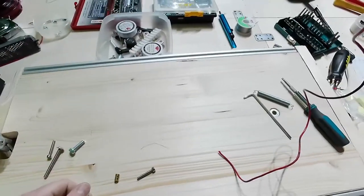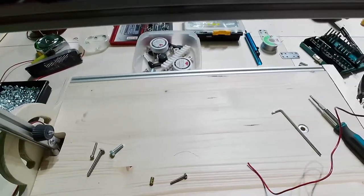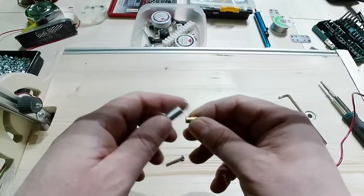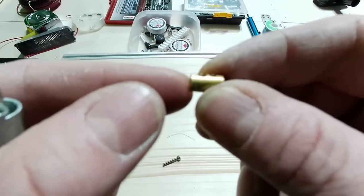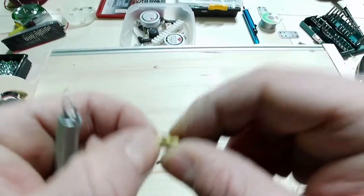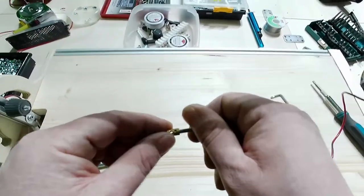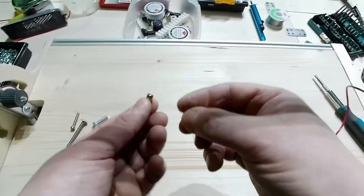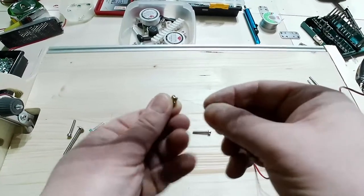So guys, I had to change my plan on the way. Okay, so let's talk about the spring. Let me use this. This is used to connect together some steel or iron cables. There is a system of screw and nut with a 90 degree hole in there. The 90 degree hole will hold down my nichrome if I place it in there.